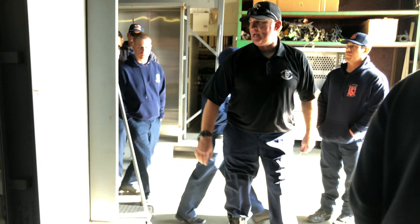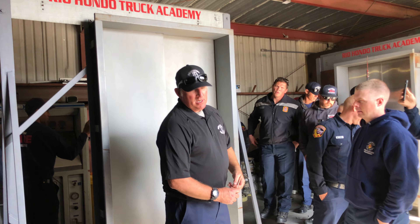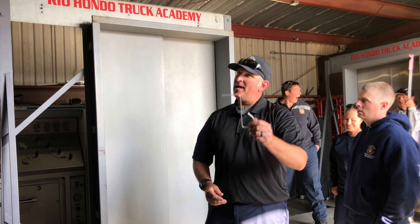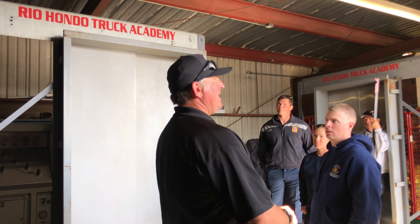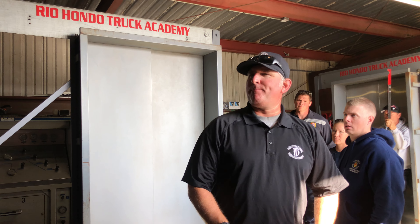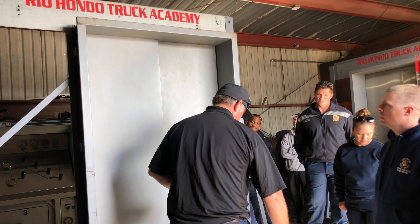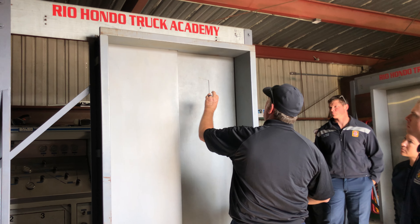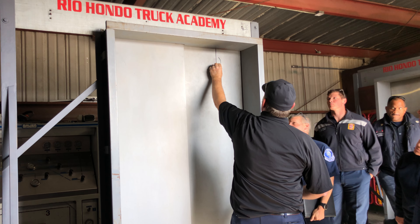Top pick — we'll start with top pick. I'm not here to sell you guys tools, but I will. Great idea to just have one of these in your pocket. Feel free to take it, scribe it on a piece of paper — you can make your own if you want. For the top picking skill, I would recommend you start the same way every time. Take your top pick, send it up in the middle of the door, turn it so that your tool is resting on the top of the door just like that. The tip of it is pointing straight back.